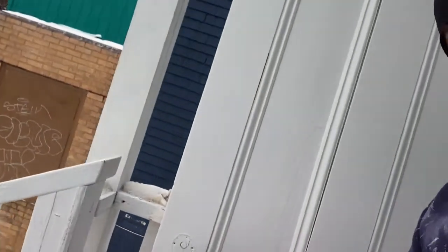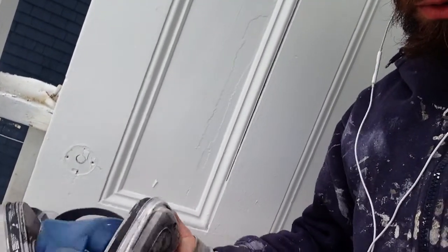Once they're sanded, we're going to give it a prime coat with a sprayer up in a room that's vacant, and then we're going to put a top coat on after that. Before the spraying, of course, we'll be filling over holes with, well, we used a wood fill for a lot of it, but some of the minor imperfections will be drydex.